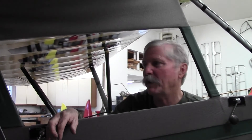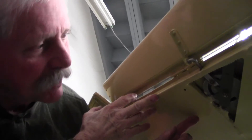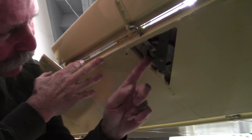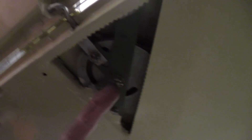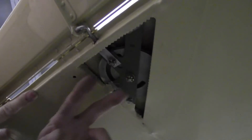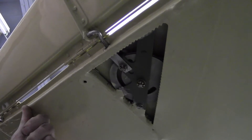On the back end, we'll take a look at the elevator back there — a couple of lube points and items to check. The back mechanism is a nonconcentric pulley with a slot in it, which actually runs the mechanism fore and aft for the trim tab. Make sure that these are well lubed and that they're clear and move adequately. If these items are lubed appropriately, you'll have trouble-free usage of the trim mechanism.